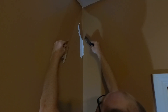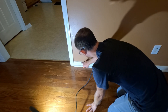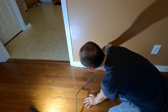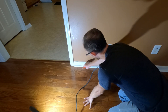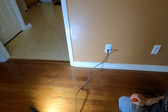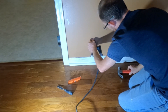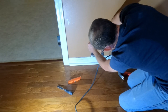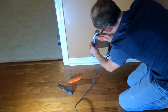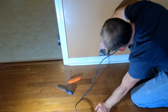That's going to be a bit of a mess. The next thing I'm going to try to do is start getting this baseboard pulled loose, and I'm going to try to do that without damaging the drywall — even though we're going to have a four-inch baseboard when we're done, so we'll cover this — but I don't want a bunch of damage back there. So I'm going to go around and try to cut the caulk, get that all pulled loose, and we'll see how it goes.